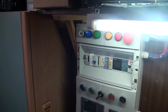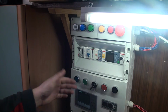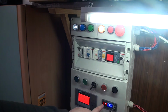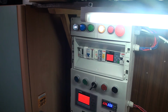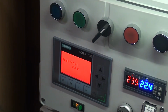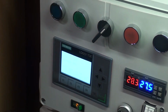So I have the sensors over here. And first of all, let's turn the power on. Okay, great, nothing exploded. So I can turn the switch on. Okay, that's great. And then the main power. Yep, everything is fine. So as you can see, now I can see there is a temperature alarm because it's 22.5 degrees. So I actually have to regulate it so you can see how fast it responds. So it goes hot very fast. So it went out, so I can reset it.